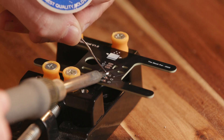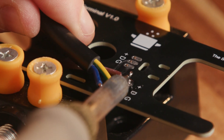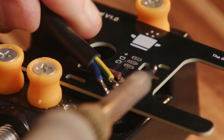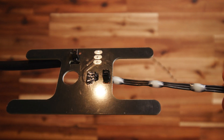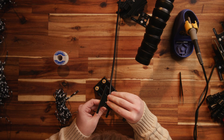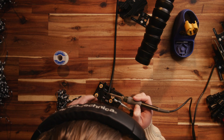Take your wires, lay them on the blob of solder we put on the pad earlier, and heat your wire with the iron. As your wire reaches the melting point of the solder it'll fall inside the blob of solder on the pad. Remove the heat and your wire should be secure and the solder shiny. If you're new to soldering, I'd suggest practicing with one of the spare terminal PCBs included in the kit just to get your eye in. Using some tweezers is really helpful for ensuring the wire is held in the right place without burning your fingers. Tin each pad with plenty of solder, then solder your pigtail and pixels to the appropriate pads.